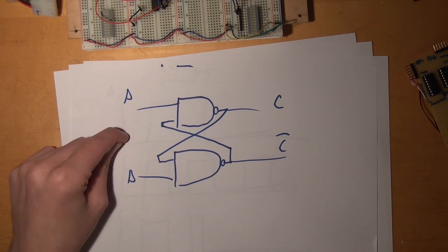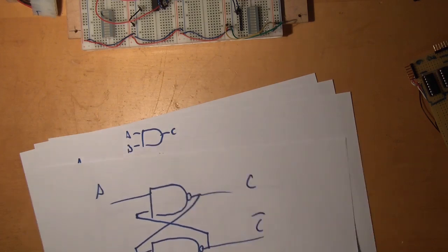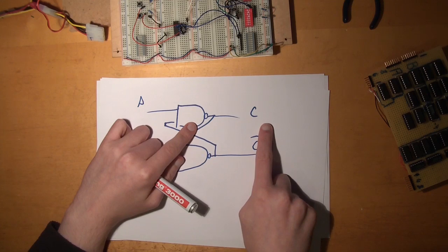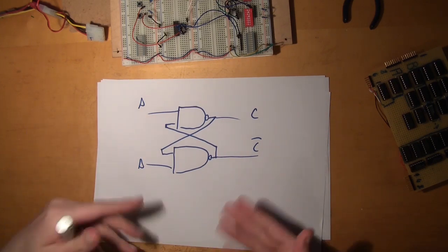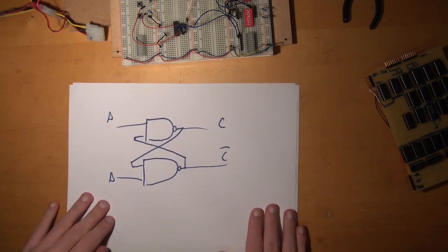These things are actually used in reality — for example, your CPU cache uses latches like this. But in real life you won't just use a bare latch, and there's a really good reason for that. In real life you have millions of latches in a CPU cache, and you don't want all of them to write at the same time. Because at the moment, when C is set, this output is true at all times — and that's the case for all millions of latches in your cache. So all latches that are set will basically fire and output all the time, but you don't want that.